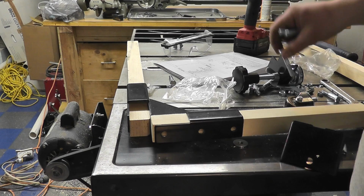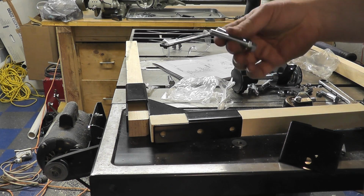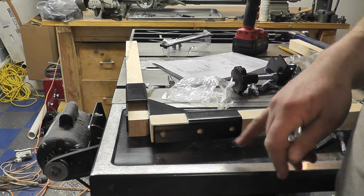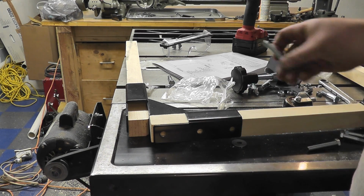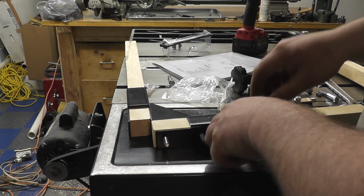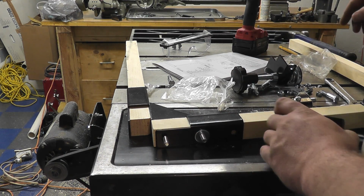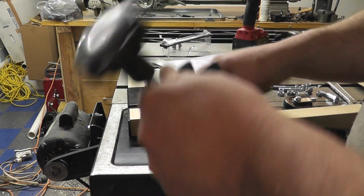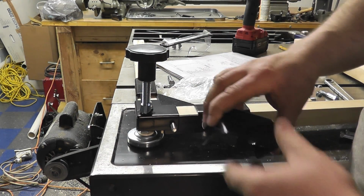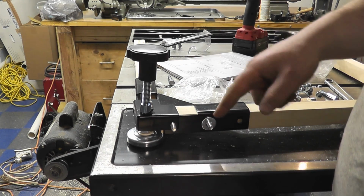Inside this kit, there are 2 types of bolts. One that is threaded all the way, there are 4 of those, and all the other ones are not threaded all the way. These 2 that are threaded all the way are for the swivel caster mount, and those go on the front side, or whatever is the front side, in the first 2 holes. Now, you put those in, and there's 2 washers in the kit. The washers go on the middle bolt. Then this end stop, the actual lock, goes on the end over that bolt, and then the caster bracket goes on, and that washer holds this level, so it takes up the space of this bracket.